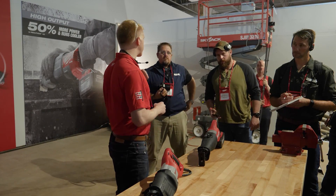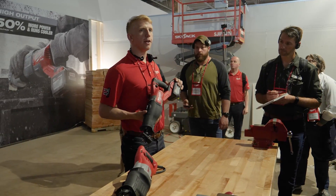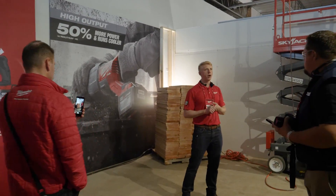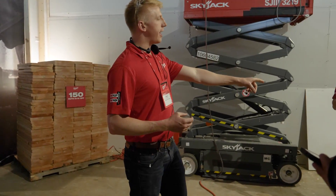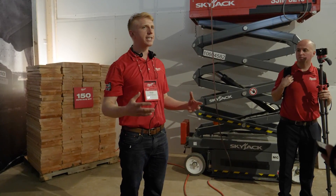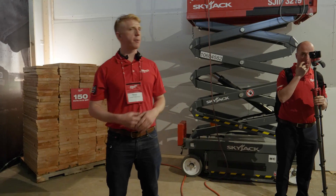Delivering full performance and full efficiency for the user. All that power and speed is going to be demanding on a battery. With the M18 Red Lithium 12.0 battery, users are going to be able to get 150 cuts in 2x12 SPF — that's a ton of work on just one charge for a carpenter or remodeler. You're going to get 50 cuts in 2-inch black pipe, and on a commercial site that can represent up to 5 floors of oil and gas riser demolition — a ton of work on one charge, limiting the time a user spends running between their work surface and the charger bay to grab a fresh battery.